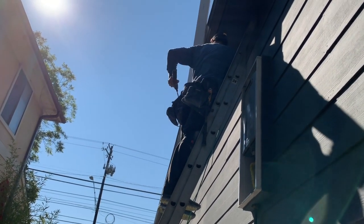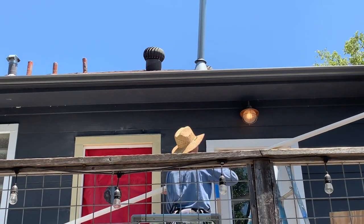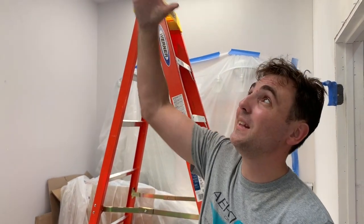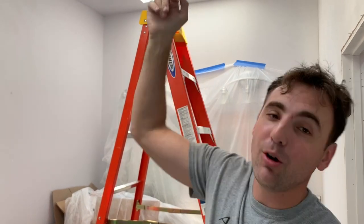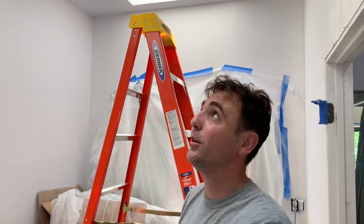We're sealing up the soffit vents from the outside. One of the easiest things to do is look around at different penetrations in your building envelope, like these skylights. Sometimes you see them sealed, which is great. Sometimes they're literally just placed on — meaning right on the other side of that sheetrock is a hole open to the attic, and that one over there is also open straight to outside. So literally outside leakage and attic leakage. The holes are big enough I can stick my hand through — we had to use expanding foam. So bugs, humidity, moisture, airflow — whenever the wind blows it's going to change the pressure inside and all that air is going to come in from out there. It's pretty intense.